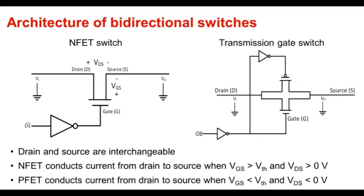Most people think of a FET switch — a PFET or NFET switch — as sort of unidirectional: you want to connect a source voltage to a sinking load. You can do that with a switch. But in this case, you actually have true analog bidirectional communication, and it can go at a fairly high voltage — 100 volts of common mode between the two.